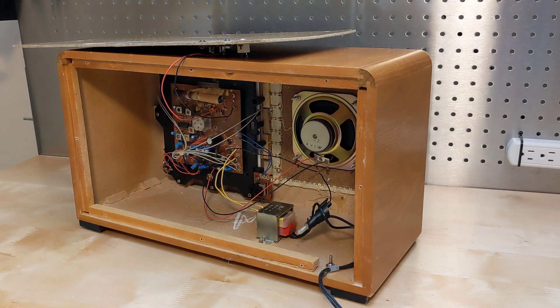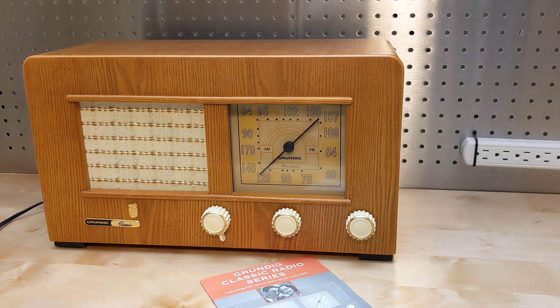This radio is now 25 years old. By comparison, a radio made today in 2023 might be a little different. I would expect even more integration — as little as one IC might be needed with no need for tuning circuits. It would likely also use digital controls for volume and tuning and maybe a digital display. The components would almost certainly be all surface mount technology, which can be assembled by automated equipment. It would also use lead-free solder and components, and any dial lamps would be LEDs rather than incandescent bulbs, minimizing if not totally avoiding wires or other manual assembly.